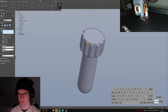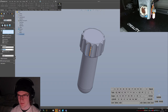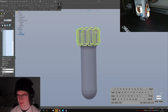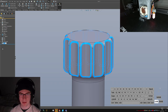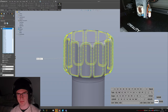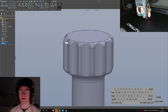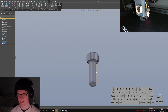There's the fillet tool. The fillet tool is magical and vastly better than the other tool. 0.6 maybe? Okay. Then we just pick one edge and then say virtual left face, whatever that is. Well, it seems to have picked all the edges I want, so good enough for me. Then I can go back to the fillet. Magical, magical tool if you want to use the fillet tool's selections and are willing to accept that instead. Then you can generate the diametrical style chamfers, but using the fillet selection tools, which are way better. Like, frustratingly much better.